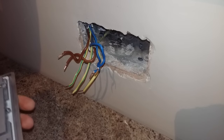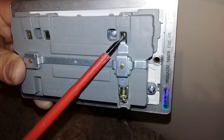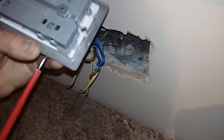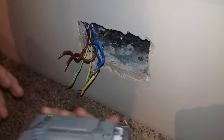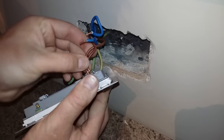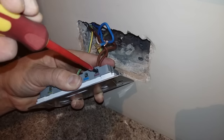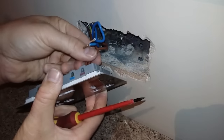Now we know what wires are what, we can go ahead and connect this up. Live goes there, neutral goes there, and earth goes there. They're all colour coded along the top, so really you can't go wrong. There's also an extra earth terminal there in case you run out of space inside the first one. Always ensure that the screws are undone before inserting wires. I'll put the two lives in there, ensure they're right in and that there's no bare wire showing, then screw them up. You need to do them fairly tight so they won't pull out.